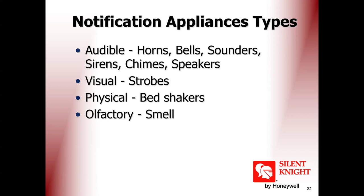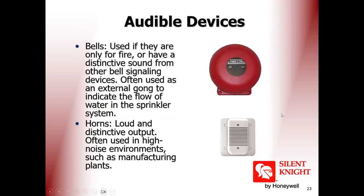We have some fire alarm control panels or brands that have speakers inside, not connected to the evacuation system. They have their own evacuation system and their own speakers inside. You will find a Simplex speaker or a Notifier speaker. This is not a siren, it is a speaker. It has a recorded message: please evacuate the building, we have some trouble, or something like this.